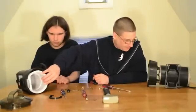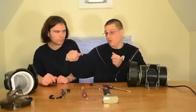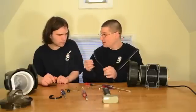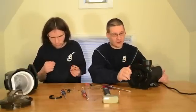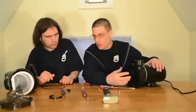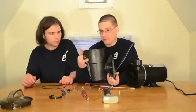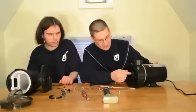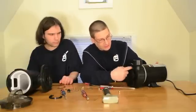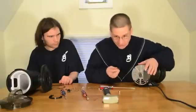Pop the o-ring back on the cover and take out the basket to clean it. There's also a little o-ring right here — pop it out with a flathead screwdriver and do the same stretch test; visually inspect it for cracks. Now here's where we see the impeller. The impeller is right here — this is the eye of the impeller where water gets sucked in, goes through the strainer basket, and is drawn into the eye of the impeller before spinning out the discharge.